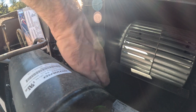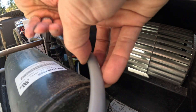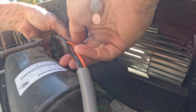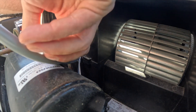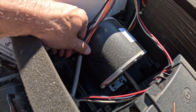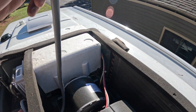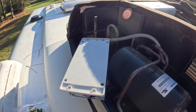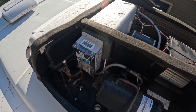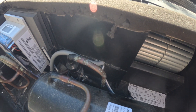I'm feeding the wires through the existing hole — it's a tight fit, but going slow and steady we can feed one wire through at a time. The wires are now through on the other side, following the same path as the existing wiring. I'm applying some 3M tape to the back of the soft start to secure it in place. The soft start is now permanently affixed. Don't forget to put the putty back into the hole where your wiring came through.